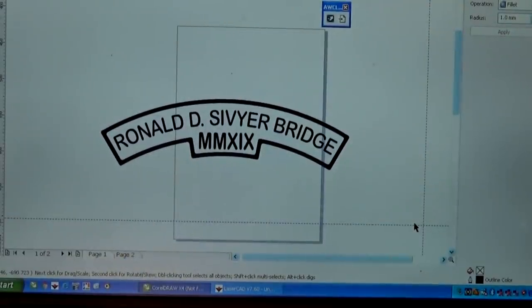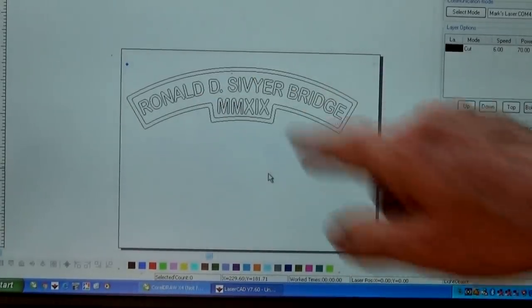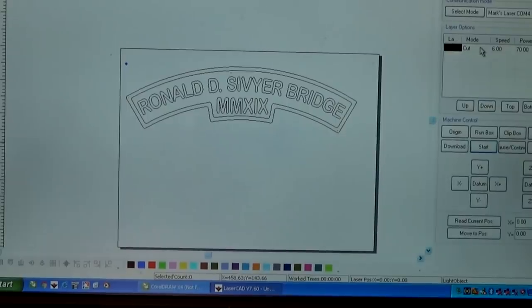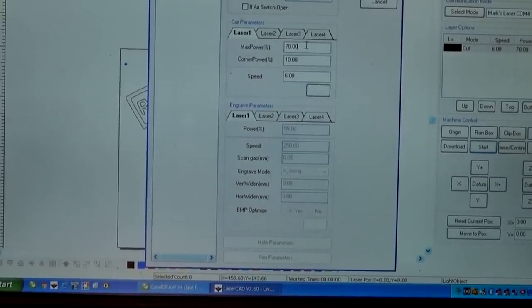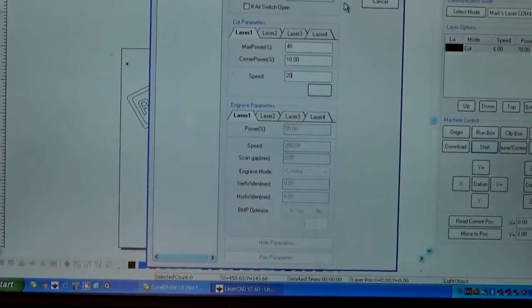Here's my artwork in CorelDRAW, and I've already transferred it into LaserCAD V7. This is the vector marking I want to put on the 6mm plywood. At the moment I've got my settings for cutting 3mm MDF, so I need to reset this just for vector marking. I basically suck it and see. The minimum power I can use is about 35%, so I'll go to 40%, and the speed up to about 20%. That's just going to burn a mark in the plywood so I can use the bandsaw to cut the outline.